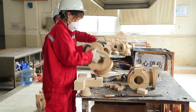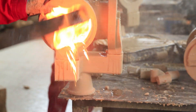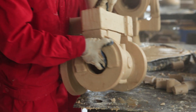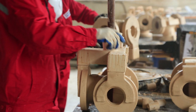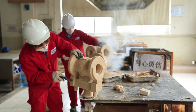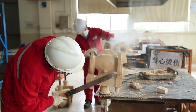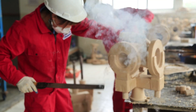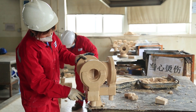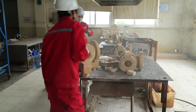The assembly process is where our skilled employees are adding the flow channels onto the valve component. These are commonly called gates and are utilized with risers. Having the correct flow channels is one of the keys to producing quality castings. As you see from the video, the valve component must be modified to incorporate gating, risers, and other process requirements. Note the amount of extra material required to produce a component. This added material is what we refer to as revert and is used in our melting practice. All components are inspected and signed off, and valve defects can actually be traced back to the operator if necessary.